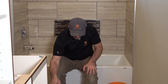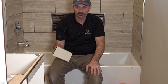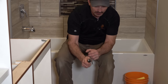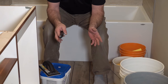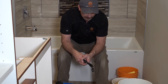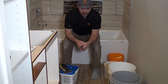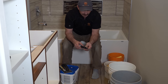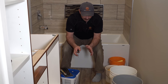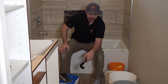So we've got our pails, our two sponges, and our grout float — I actually bought a brand new one for this video. You're also going to need some type of instrument to clean between the grout lines. After grouting, once it's sat for 24 hours — which is what most mortars require before walking on it — you're going to have spots where the mortar squeezed up through the tiles and you need something to scrape it down. This little hand scraper is nice and easy; it's abrasive on the edge so you can file that off. So one of the first things you want to do is go across the whole floor looking for spots like that, and then bring in the shop vac and vacuum out the dust.